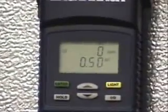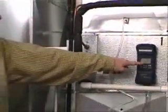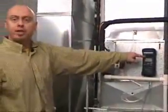I've shut down some of the return air. So now the technician came out. He accessed the wrong testing locations — he is on the plenum area, in the return air drop. He reads his meter. His meter says 0.50 inches of water column, which looks like a pretty good number. He comes over to the nameplate of the unit and says that is normal — I'm right at the maximum level, so I have a good duct system. But that's not true.